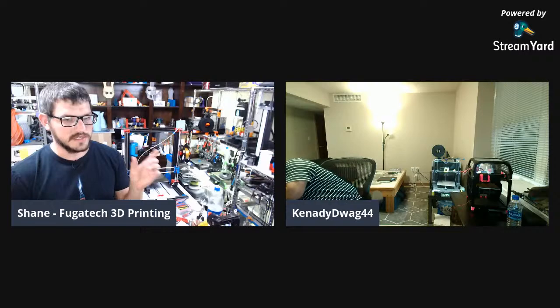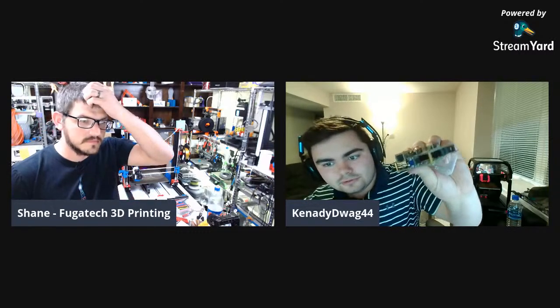Yeah, I guess the one issue is I'd have to use that other hat that I have, because Zeros only have one USB port. It's buried in my stuff, but I have that one where it plugs in with some pogo pins to the 0W, and it gives you 4 more USB ports. Yeah, this is the one I use. Okay. But instead of plugging in this USB to the SKR Mini, I wire the Pi GPIO to the SKR Mini serial connection. Okay.